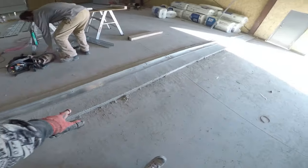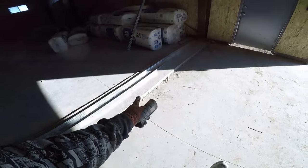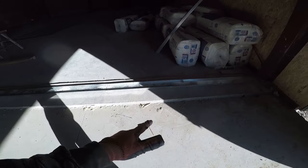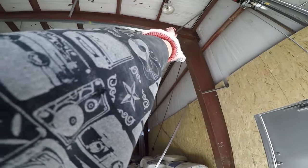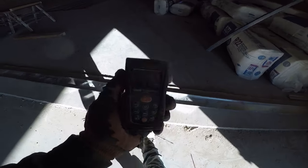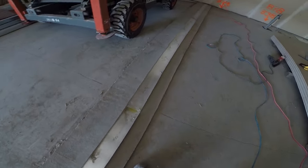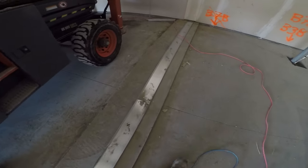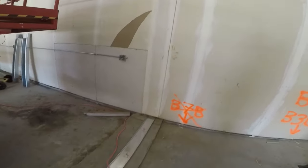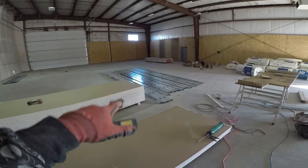This is a two-foot center wall. Whether you're doing two-foot or 16-inch centers, do your layout on the bottom and then we're going to laser up to the top because of the angle — you won't be able to draw your tape across, it'll be wrong. We'll use the laser distance finder to take our measurements. All measurements are written on the track already, so just make a list of things to cut. Tracks and layout are done, studs are laid out and ready to go.